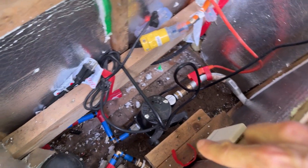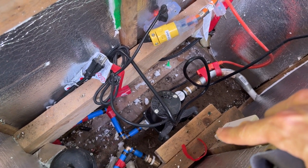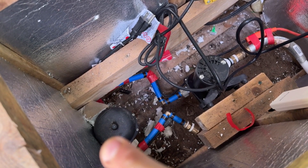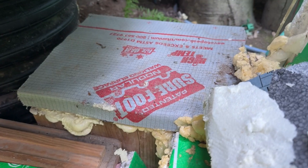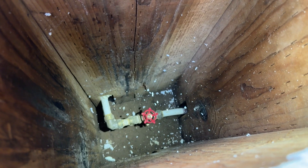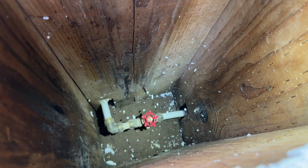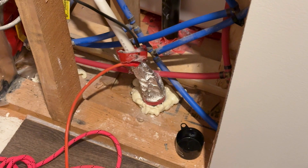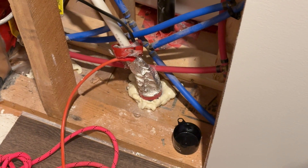The top pipe comes down into two-inch PVC, teed off here to the top tank, with another tee down in my little box — a bunch of reducers down to three-quarter-inch PEX, coming over here into our pump box. That feeds into our black pump, which comes over to this little pressure tank, and then out through a shut-off valve. Inside that pressure-treated box we have our shut-off valve going straight into our culvert, which goes up into the house.